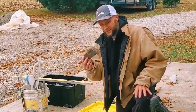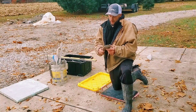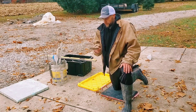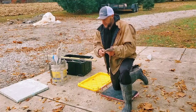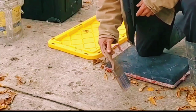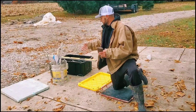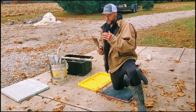A paintbrush — why would somebody need a paintbrush? A finisher should keep a paintbrush in his bag for one reason only: for when you're on some wet concrete, say something in the shade, and you've got to get a broom on it. You can brush really lightly with this and barely leave any marks. You can't do that with any of the other brushes. So I suggest that every finisher keep a paintbrush with soft bristles. And I really don't think a finisher should have to supply a bull float or bull float handles.